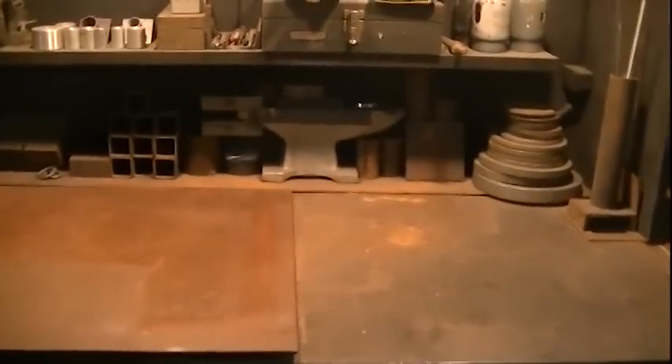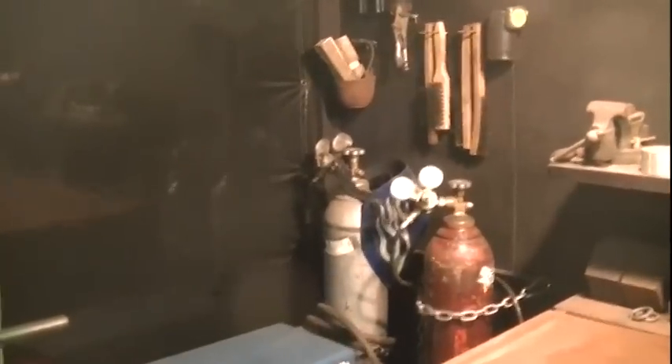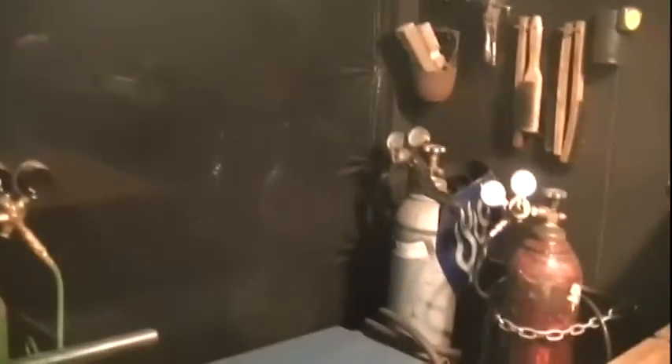And the only poster I have in the garage — yes I'm a geek. Some 6x48 belts, and then all of the other belts are stored here. And this is a welding curtain — it's actually a shade 10 welding curtain, and that leads into the welding area. The reason that's there is so if I'm here, say, teaching the welding merit badge, I can be on this bench welding with the scout, and their parent can be right on the other side of that curtain, completely safe and protected, don't need any kind of special gear. They can watch exactly what's going on as long as there is an arc present, because it's just way too dark to see through without an arc.